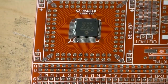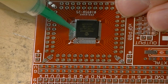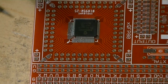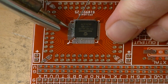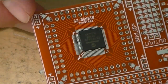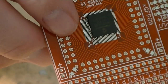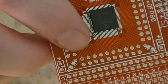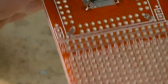Now we'll come back over to the QFP chip and try it out here — just put a little bit of flux along this edge of the pins and solder that. Now we've got too much solder on here, it's bunched up, and we'll still have to use a little bit of solder wick to get rid of it. But you can see already that where we used the flux, it's not joined together — there are no bridges on the chip. What we did without the flux, it was bridged right away and we had to wick it up. But with the flux, even though we just kind of drag soldered along, there are way fewer shorts and it's a lot cleaner join.